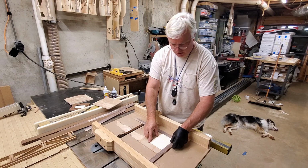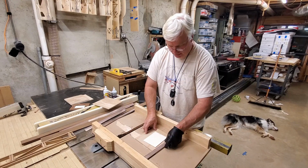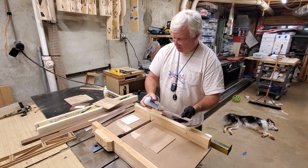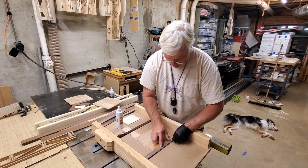So our first step is put our blank piece of plywood down, our backer plate, take a piece of our spacer that is probably 3/16, and we're going to glue it on. I'm wearing a glove because, one, I don't like gluing my hand with all the CA, and two, I don't want all that kicker on me, as much as I can avoid. And again, it doesn't have to be perfectly straight. Don't worry about that. Just get semi-straight because we're going to straighten it up later.